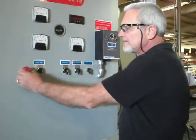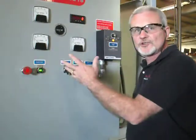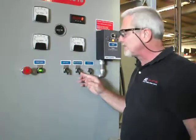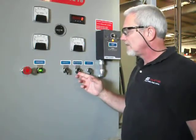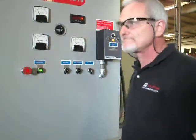You want to reset the total system. To do that, pull out your safety stop and push the reset button that energizes your control panel. The next thing that you do is you turn the dust collector into the on position. Then you turn the blast cycle on. The blaster sequentially starts: auger, blast impeller motors, upper and lower.